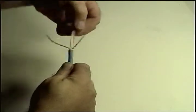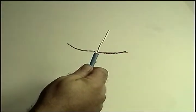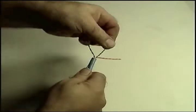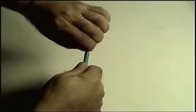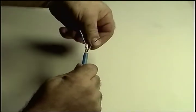Now we go to the other end of this very short cable run, and when we spread out the pairs, the natural orientation puts brown on the left and blue on the right on top, and green left, orange right on the bottom. So to make them the same as the other end, which we want, we have to cross the pairs, like this.